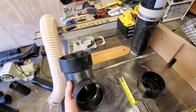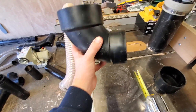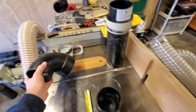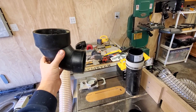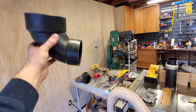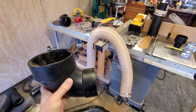This particular piece is actually a toilet bend — a 4-inch toilet is intended to be up at the top connecting to a 3-inch drain. But it works great for these kinds of 90-degree sweeps where you want to convert from the overhead ducting that comes down to flexible tubing that comes out the bottom. I use this one by running rigid piping all the way down the wall, and then I have this sitting on the floor, and then the flexible tube hooks in, and ultimately it's the connection for the table saw.